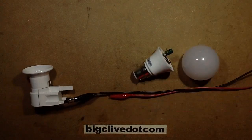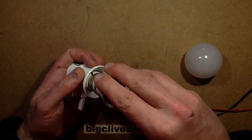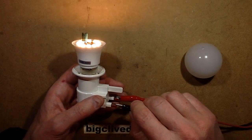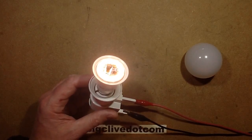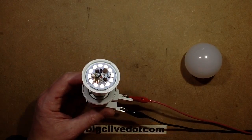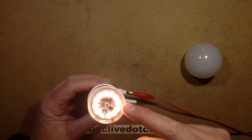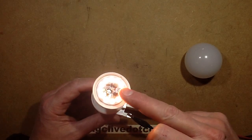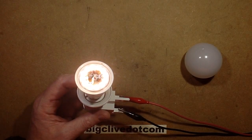This video is about the low-voltage one. Keep in mind it's running at 12 volts, and because the LEDs are wired in series multiples of three and the circuit is a buck regulator, the voltage starts trailing off below about 11 volts — that's where it stops regulating, which must correspond to the forward voltage of the LEDs at about 9 volts total. I've measured exactly 3 volts across each LED string at full power, plus losses in the regulator and bridge rectifier, which will drop at least a volt, maybe more.